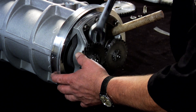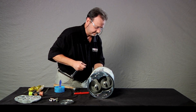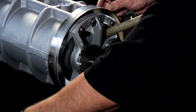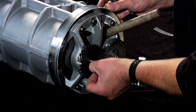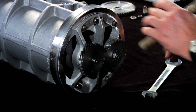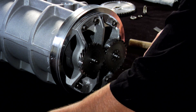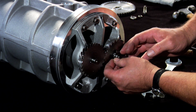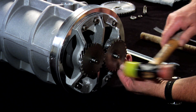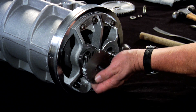On the opposite end of the measuring unit you'll find the timing gears. Again, insert the blocking stick to stop the rotors from turning and loosen the lock nuts with the wrench. Remove the lock nuts and locking rings. Remove the blocking stick. Remove the timing gears — you may need to tap the gears with the rubber mallet to get them loose. Once they're removed, set the gears aside.